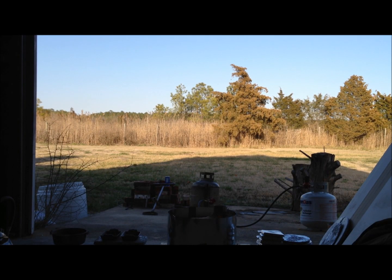Time to pull the lid off. Take all the dross off the top of the aluminum, flux it, degas it, and pour the mold. Wish me luck. Here I go.